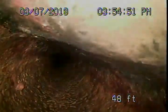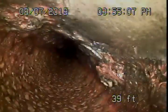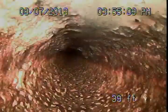Running the blade sometimes cuts away the rust and opens up the pipe a little bit. Besides that, replacement of the pipe will obviously need to be done at some stage. You can see there's quite a bit of rust buildup in the pipe. We don't see any breaks, roots, or anything getting into the line. Ideally, the best thing would be to replace it, but it is functioning with heavy rust buildup.